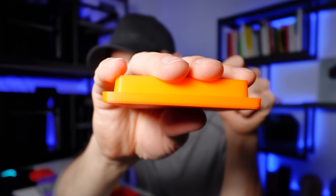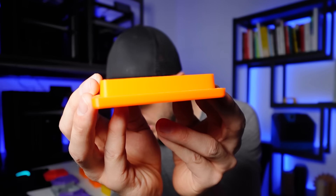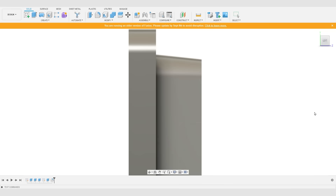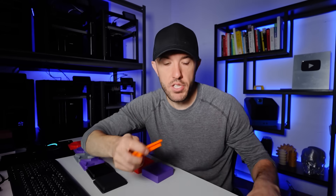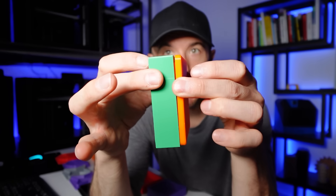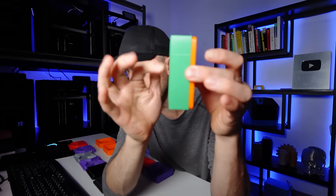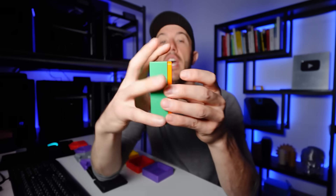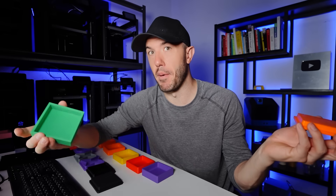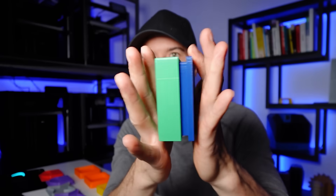If you round it off you no longer have that 'bang bang' location — the sharp corner where you have to change direction. You get a rounded direction so it fits very snugly, and the side faces are far truer than sharp corners can be. On the bottom, always add a chamfer to eliminate elephant footing concerns. Another simple trick is a small chamfer on the side edge — slightly angled — so instead of one single dimension everything has to fit to, you have multiple dimensions so the lid will at least start and can then be pressed in the rest of the way.